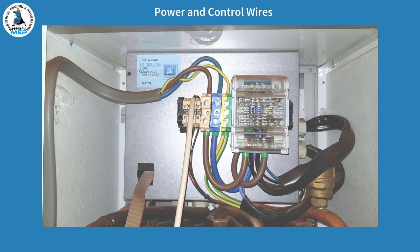Let's have a look at the electrical supply and the control wires. You can see the main supply here, and then the thin wire is the control wires — being the room thermostat — and that's connected here. This unit should be connected to a 63 amp RCD isolator switch. You can see the main wires coming in, which go into the contactor. That's the main live and neutral.